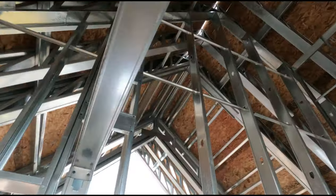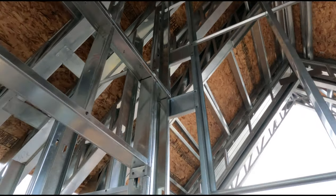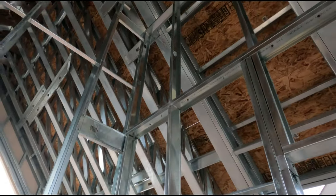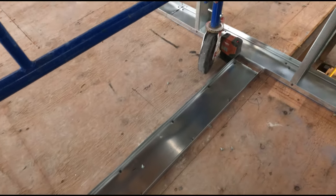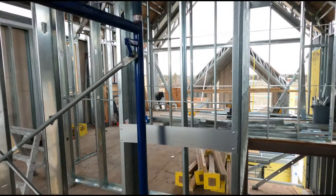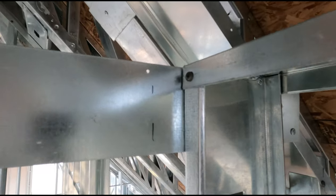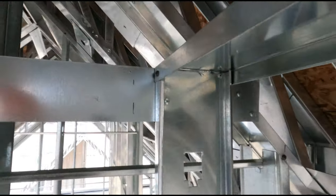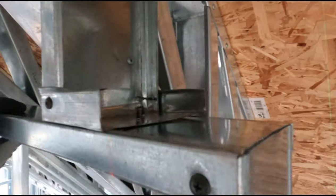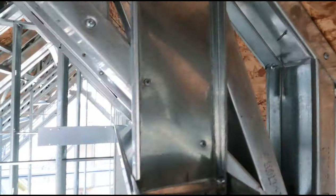There's the flat stock — you can see how many clips I use. I'd use two for the upper part and one for the bottom, or sometimes two if I needed extra strength. You plumb it up, add more clips for extra wall strength. Normally the drywall will slip in behind and then you lock in the floater. Braces are very important — I've got more videos coming on how I brace everything. In this situation the drywall is just gonna go straight up and all that will be hidden.